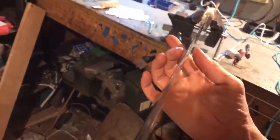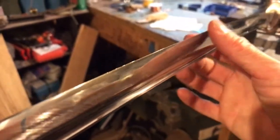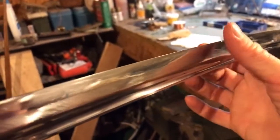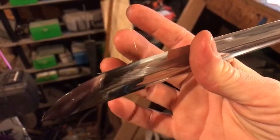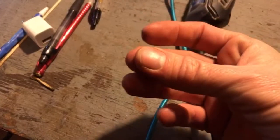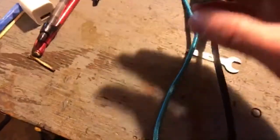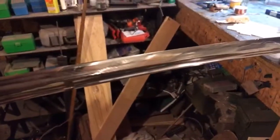And we used the belt sander up to this point to get that nice fine edge. And as I was finishing up the final sand, we were talking about finding that little silver line, which is the burr edge. The burr edge would peel off a little bit into these long, beautiful pieces here, like this. That burr edge will get smaller and smaller and smaller until it's as thin as a hair. But that's just because our eyes aren't very good. If we had a microscope, we could still see a lot of jaggedness on that edge.